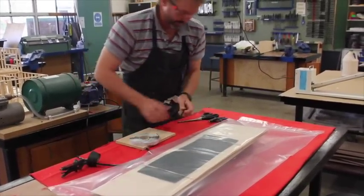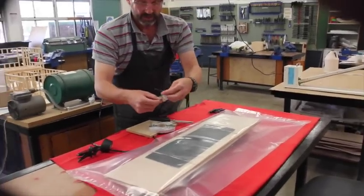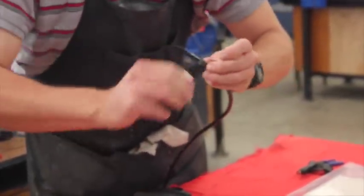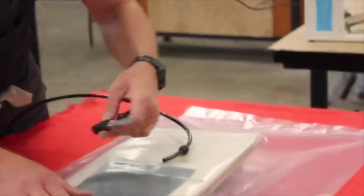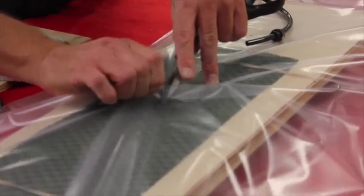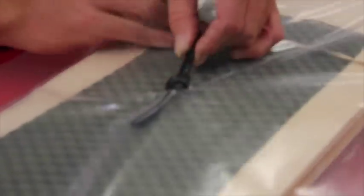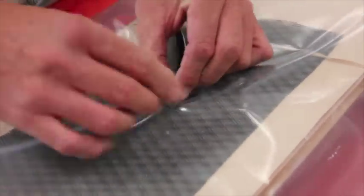There are different methods of putting them in. The one that works for me is I'll just cut a little piece of tacky tape - just like that, it's double-sided rubber tape. Peel that off, wrap it around. And then punch very carefully a hole in the bag - make sure you don't do two holes at one time. Use a pen or pencil. That's fitting there nice and tight. As I push that in along the surface, I'm going to smear that tacky tape right down so I know I've got an airtight seal.